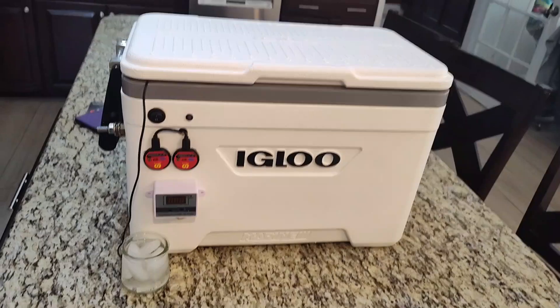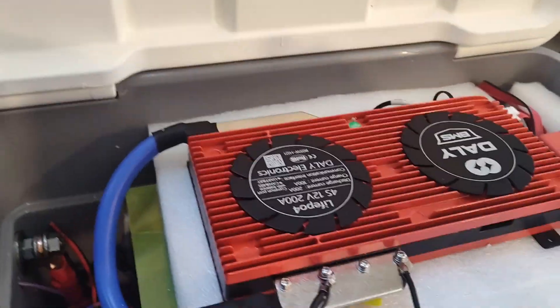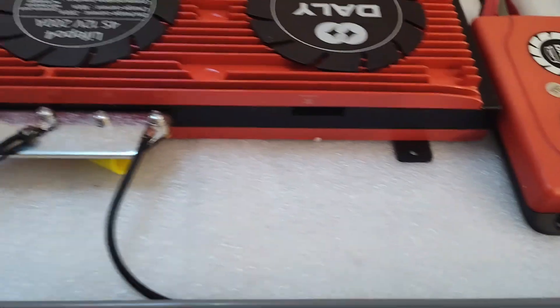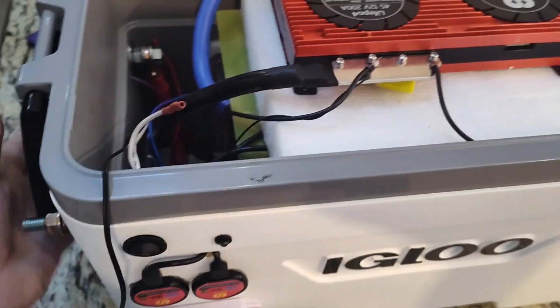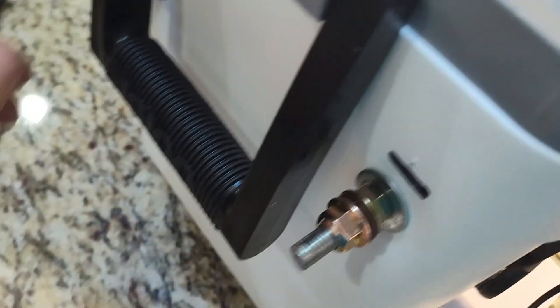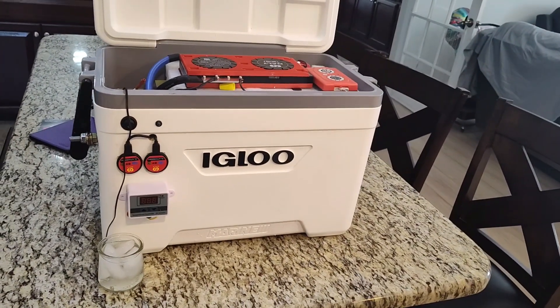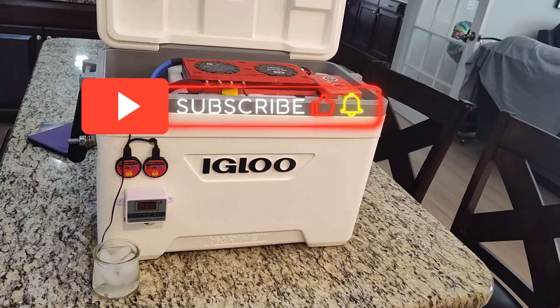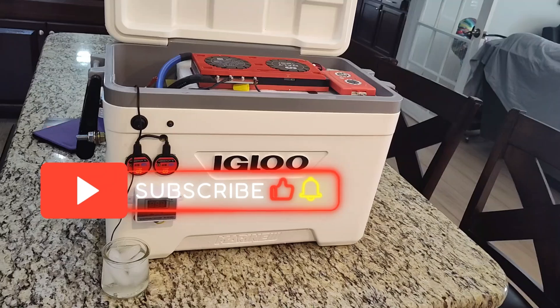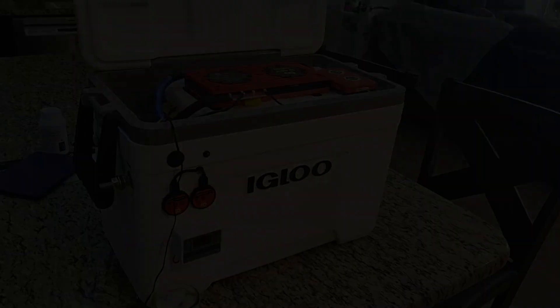So if you want to build yourself a four-season lithium iron phosphate battery that will heat itself and report back to you, I've got a smart 200-amp BMS along with a one amp active balancer — it does a good job managing these batteries. This is a 25-quart two-day cooler, so the insulation is good. The terminals are through the front, and the Bluetooth connections are on the outside. I'll put a link in the description on how to build a 280 amp hour lithium battery — you can put it in any case you want. Talk to you later, bye.